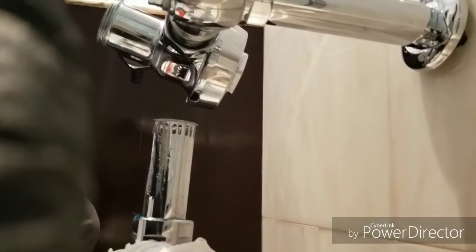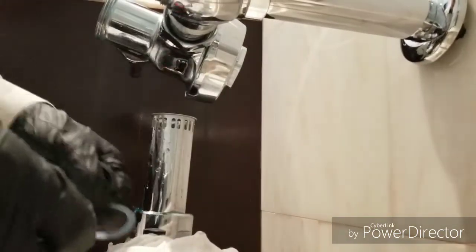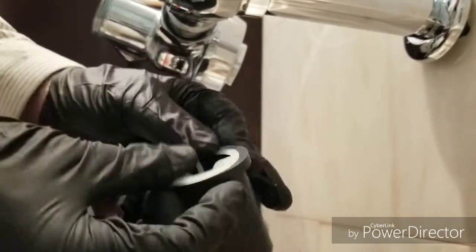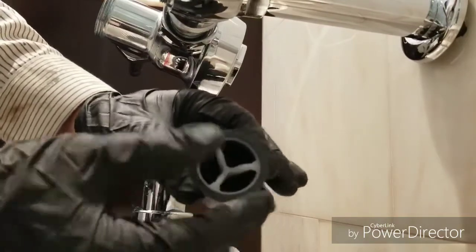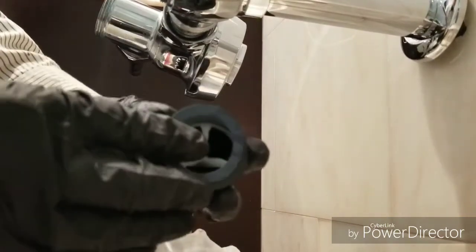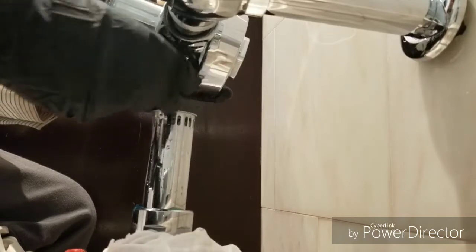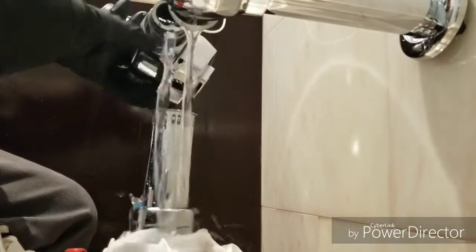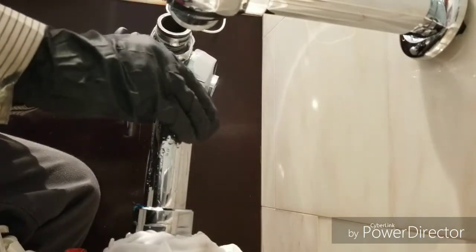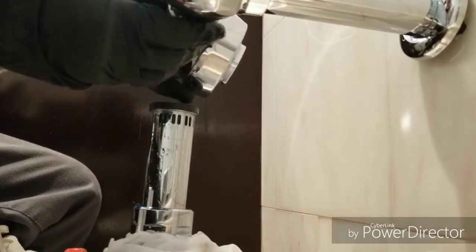Garbage — I'll get the new one. Here's our new vacuum breaker. O-ring. What you're going to do is take this and insert it inside this, like so — it's going to go inside. Then take your o-ring and put it on top, then slide it in place. I hate messing with these because they drip on the end there, but I will take it out just to make it easier to get this in. And pop that in like so. We'll see if it leaks — that o-ring doesn't look so happy, but I don't like messing with these.